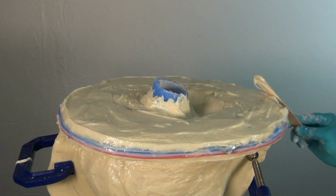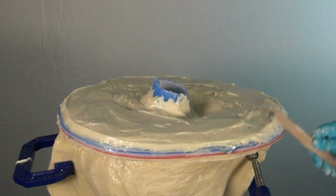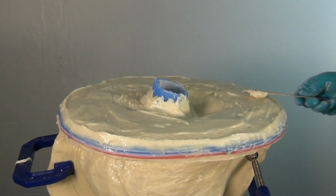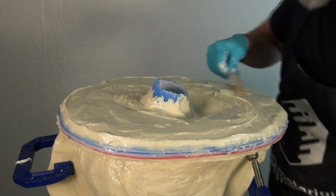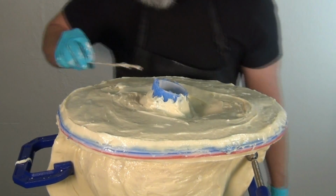And that's a good way to gauge the thickness of your mold, and check that out and make sure you have a nice thick mold, especially on this base, because again, this is one of those areas where the mold's going to be flipped over and sitting on this part. So you want it to be nice and tough so it will withstand that in regular casting operations.